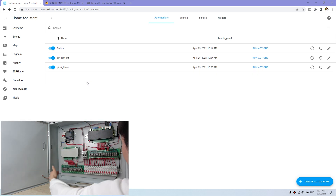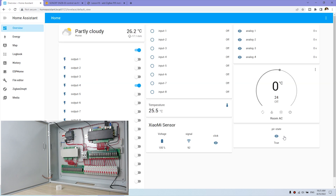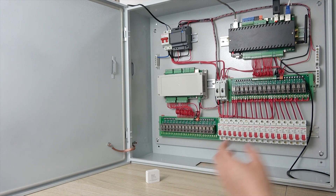Now when I place my hand in front of the sensor, it turns on — you can see channel 4 is on. When I release my hand, there is a delay time, so we wait a moment. You can see on the website it is still true. When it becomes false, relay output 4 will auto turn off. This completes the whole automation: using the PIR sensor to turn the relay on and turn it off. You can use this method for many other automations. Thanks for watching, see you next time!